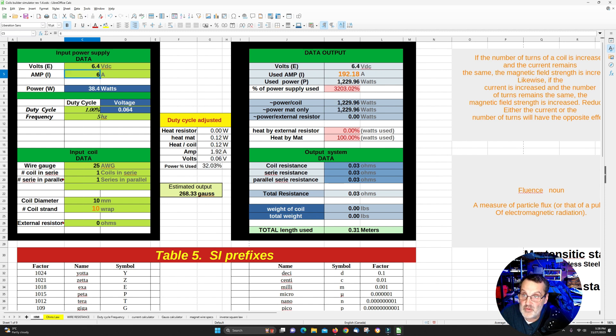Now we have 3.2 volts. We're going to rebuild batteries, that's going to go at 6.4 volts — they're 3,500 milliamps each, which is 3.5 amps. Now the trick is there's another way to use the calculator. I know my coils are just under 9 ohms — 9 ohms each, those PCB coils. So if I take the resistance of my wire, which is about 0.3 ohms...